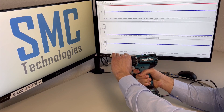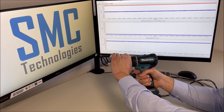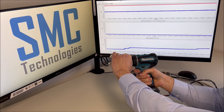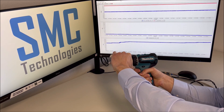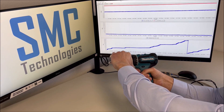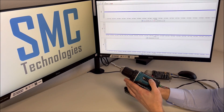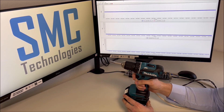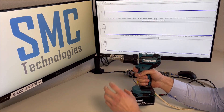You can also block the rotor completely. Right now we are at approximately 300 degrees electrical — you can see it on the third window. We can let it rotate slowly in the forward direction while providing the full torque. If we change the gear ratio we get more torque but less speed; in that case I will not be able to hold the motor by hand to block it completely.